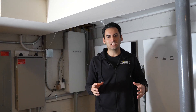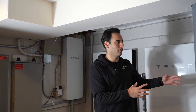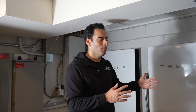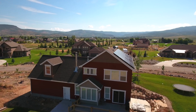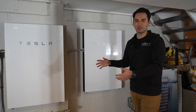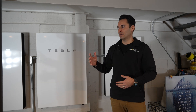It's a lot easier to add a battery to full home backup. The other thing to consider is if you're doing full home backup and you added a fourth Powerwall but only have 10 solar panels on the roof — you have to understand that you won't have enough solar power in a grid outage to support 54 kilowatt hours of storage. Knowing how much solar is on your roof to charge the batteries is critically important.